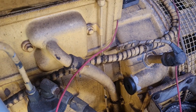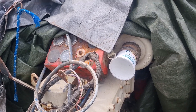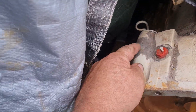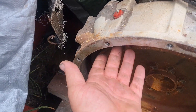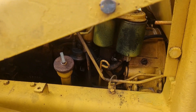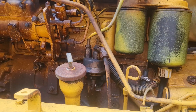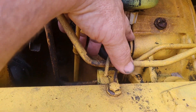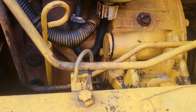I've got a few engines here so I'll show you the same spot on all these engines. This one is a marinized 6BT, and there is the same spot that you put the tool into — it engages on the ring gear of the crankshaft. This is the 4B on the Case 580E backhoe, and again the same position: you pull that little bung out, slide the tool in there, and away you go.